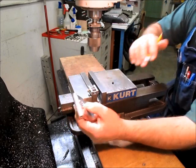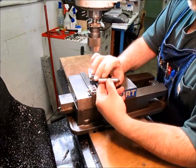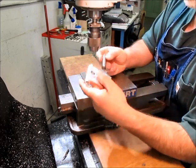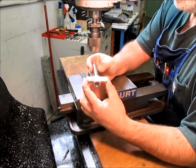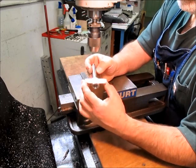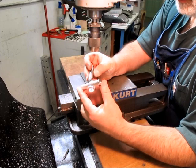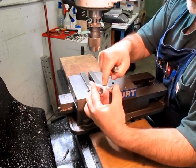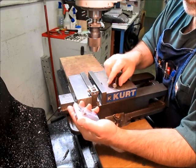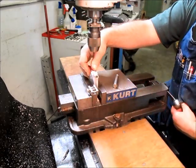So we got to put the little shaft in, and this is the shaft. They had a roll pin going through it before, but they didn't put it on center, so it was just kind of rough drilled, and it was a permanent assembly, never intended to come apart. This is a press fit now, but I still want to put some kind of retention pin or screw in it. I can't pick this hole up anyway and figure out where it's going to be when I press this in, so I'm not even going to try. I'm just going to drill and tap and put a set screw in the top here, a little number 10 set screw that'll go into a dimple on the shaft. And if somebody needs to take it apart, they take the set screw out and press the shaft out. So we'll go ahead and do that now and then finish this thing up.